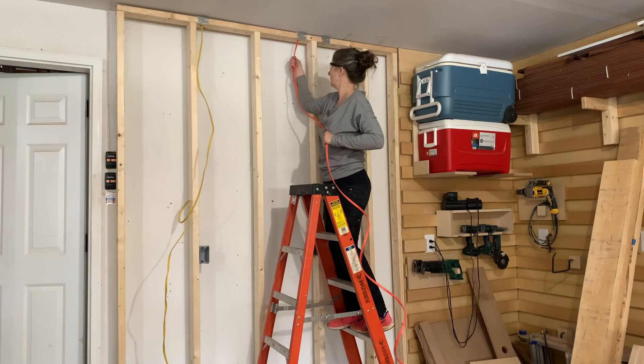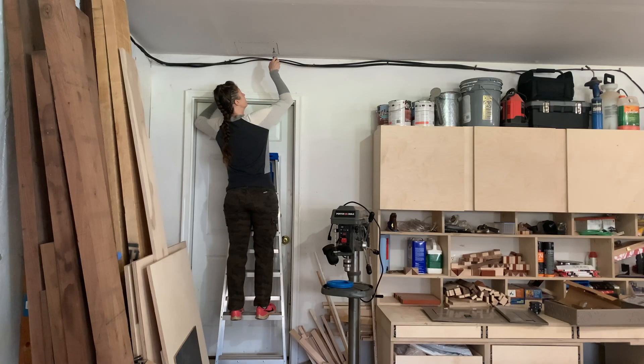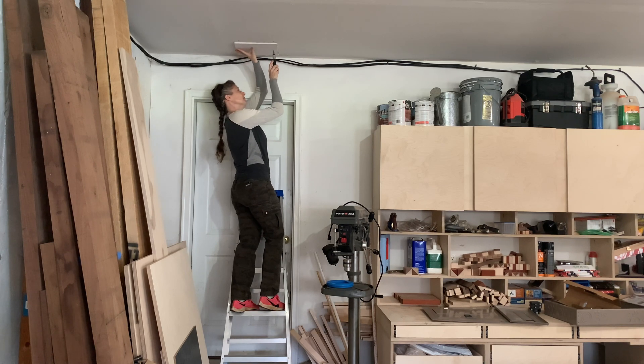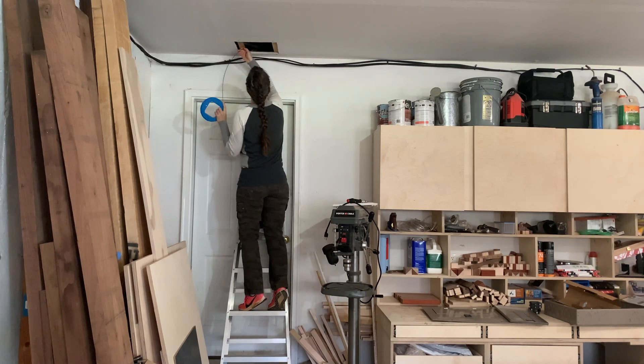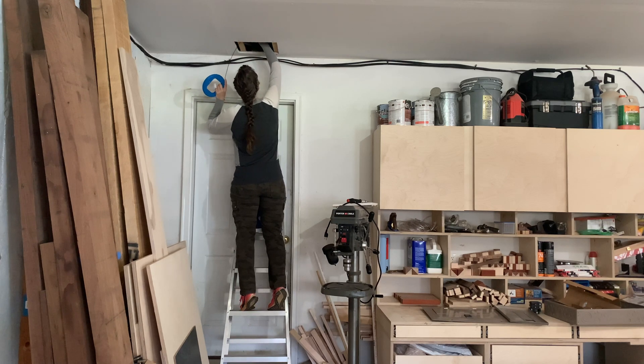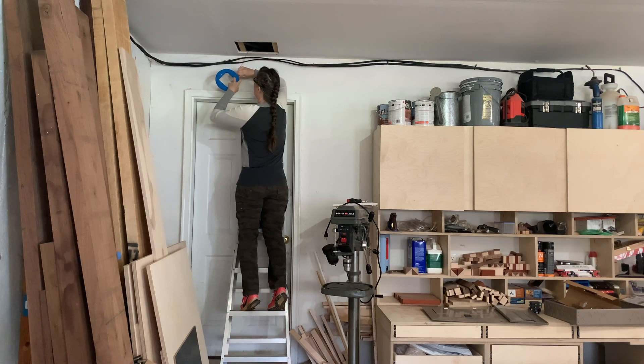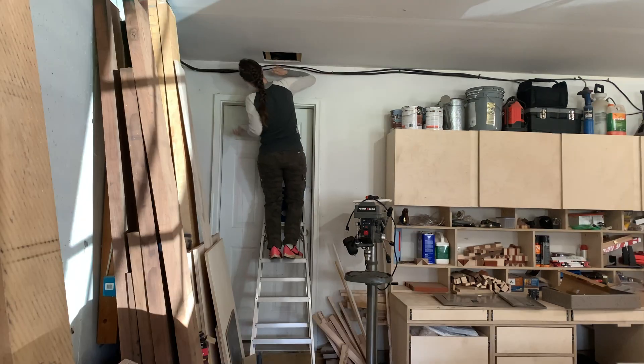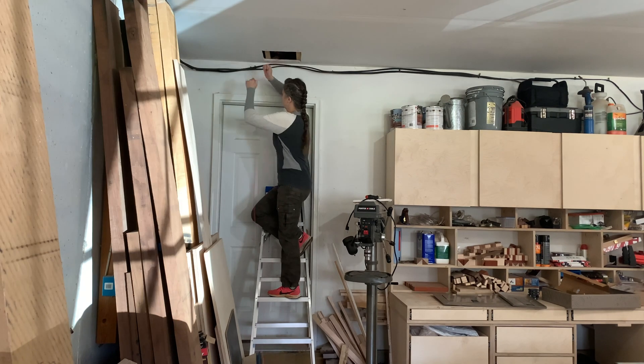First, I'll push the wire up through the ceiling, and then I'll open an access point at the other end of the garage. I actually didn't cut these holes in the ceiling — they were there when we moved into the house, but I haven't closed them off because I've been doing so much electrical work in the garage. I'll use a wire fish tape to pull the wire through this section. There is a small room on the other side of this door where I don't have access to the ceiling, but because it isn't a very far distance, I can just run the fish tape and pull the wire directly.